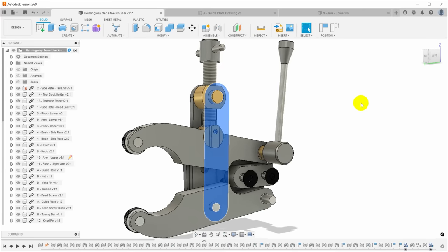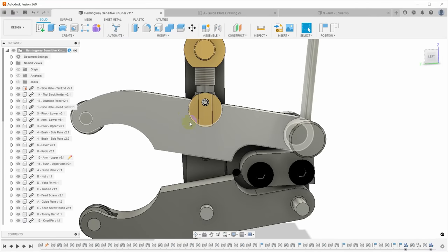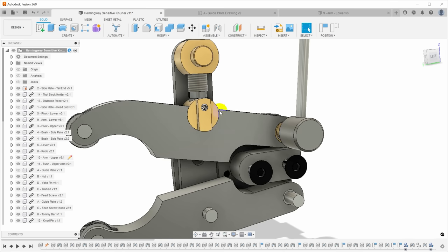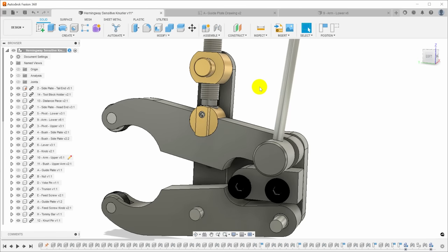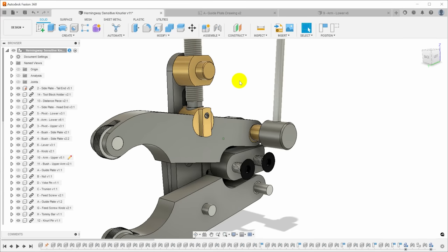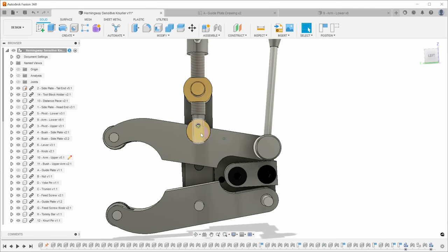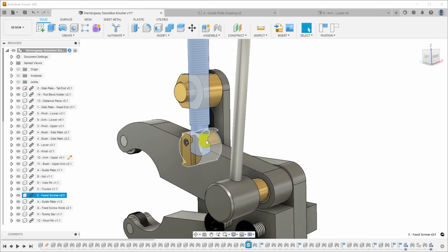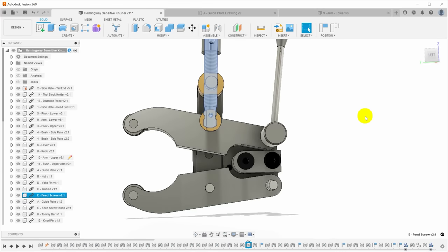The feed pressure assembly on this knurler is quite neat. You've got a brass nut with a screw that goes into a brass part fitting into a bored opening in the upper arm, submerged far enough that it can pull the arm up and support it as well as provide downward pressure. There's a lot of surface area, so the brass-on-steel bearing should be very smooth. No springs needed because the screw is captured with set screws in a groove, so the screw can pull up on the boss, which pulls up on the arm. It's a clever little design.